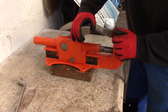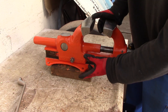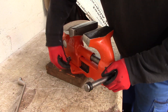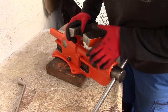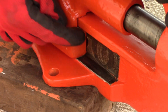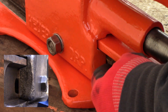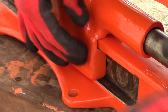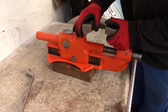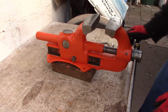It works quite well. I still have a little play because I couldn't get the perfect shim stock - I would need a 1.1mm thick one but could only get a different size. When you clamp the flanges together you have contact at the bottom but you can still wiggle at the top a little. The bronze shim will probably wear down after a while and then everything will contact and the wiggle will become less. But right now it's much better compared to before where we had a lot of play.